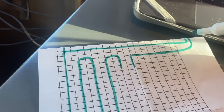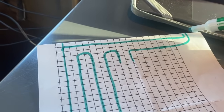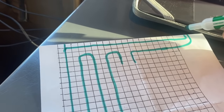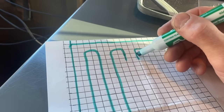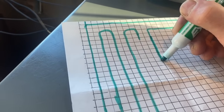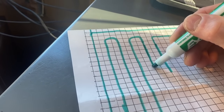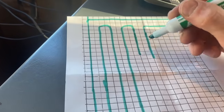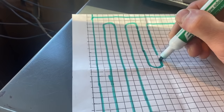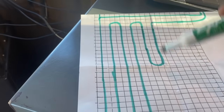Okay, guys, so I started back feeding from here. Like I said, I cut the tubing off at the 600 foot. They gave me 400 foot. I stuffed this up into the manifold. And I work backwards. And then I just kind of work the tubing in to wherever it falls, guys. Wherever it's going to fall, so I have no waste. I have exactly 400 feet of tubing. So say it comes to somewhere around here, let's say. That's what we got. So we know right now that's 400 foot of tubing.